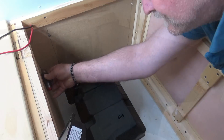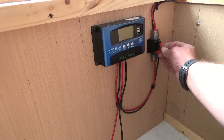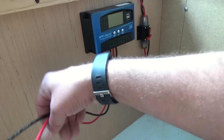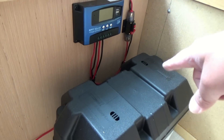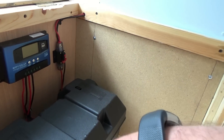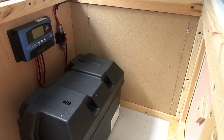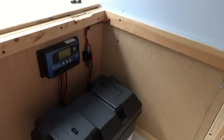Let's go ahead and get those installed. So what Jack's got done so far: wires coming in from the solar panel, we have an inline fuse, and right now it's turned off so no power. We've got the wires coming to the controller — this part is the solar — and then we've got the two wires coming out for our battery. Next is to install the battery box, put the battery in, start making the connections, mount the inverter and get the wires connected, then we'll have power to the equipment, then it's just a matter of running some cables to switches and getting power to the refrigerator. That's the ticket. It's a nice little clean setup.